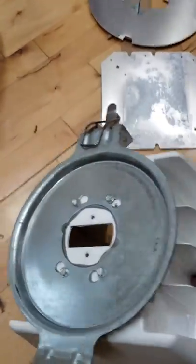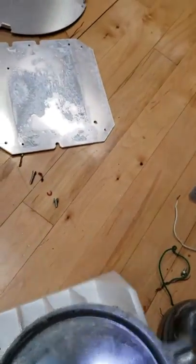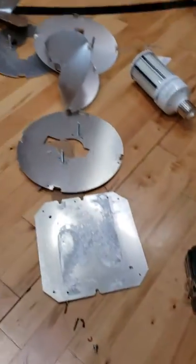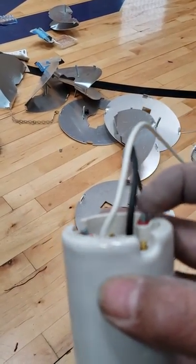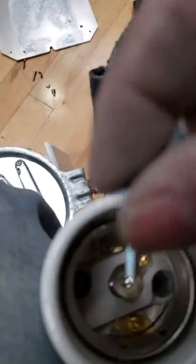Get the bottom part and make these holes a little bit bigger so your screws can fit through. Make the hole bigger with a drill, just a little — not too much. You also need a bigger outlet so it can fit the larger bulb. The reason for the new screws is that the ones that come with the outlet are too short, so push those out and replace them with the longer ones from the box.